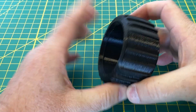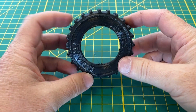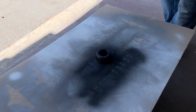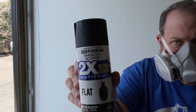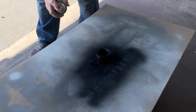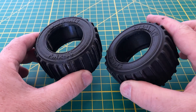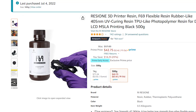Because they're FDM, we get layer lines that I'm just not a fan of. The heat from extruding also tends to make them pretty glossy, which is not what I want. Pro tip: give your TPU tires a generous spray with flat black paint — not gloss, not satin, not matte, flat. I use Rust-Oleum paint primer flat black, available at Walmart for about six bucks. You can go kind of heavy with the spray to help hide some of the minor layer lines. The tire will be tacky for a day, but once it's dry it looks much more like a rubbery tire.